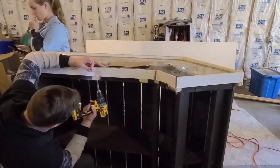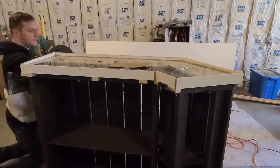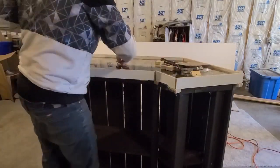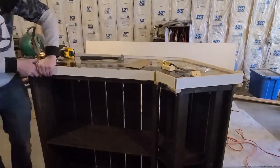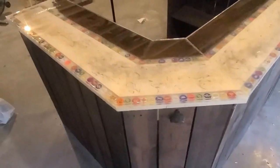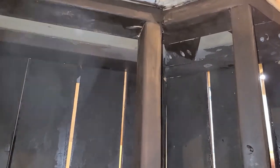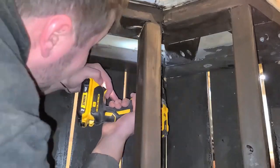Now that the last pour of epoxy was finally dry, we removed the blocks at the bottom of the surface. Taking a piece of cardboard and a hammer, we slowly pounded the melamine off the epoxy top, sliding it against the cardboard to avoid damaging the epoxy surface. Just like that, the top was done. The last thing to do was put in clips to hold all the power cords and lights, route the power strips and lights through the clips, and then we could give you a tour of the finished bar — minus the foot rail, which would come after the tour.